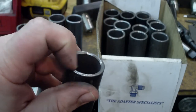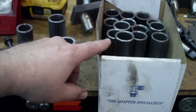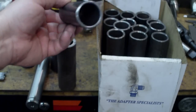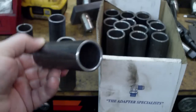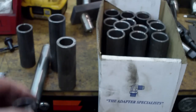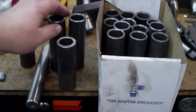Here's a whole bunch of them with chamfers on them. They're all different lengths because we have four different sizes of hoists. The problem comes in when you're putting a big hoist in — the tallest one here doesn't have a chamfer on it yet. You're getting ready to weld it onto a part, welded onto your cross member for a Ford, like I'm getting ready to do — it's already hot sitting there waiting on me. I've got one done, I can go weld that right now and do the other one later when I do the upper part of the hoist. But I decided to put a video out so you can see this one extra step: it goes in the lathe, gets the chamfer put on it.